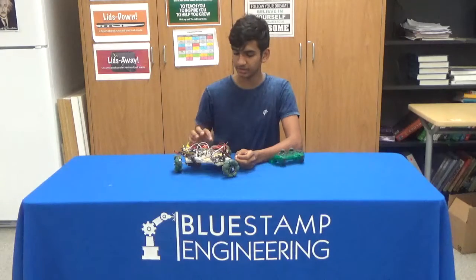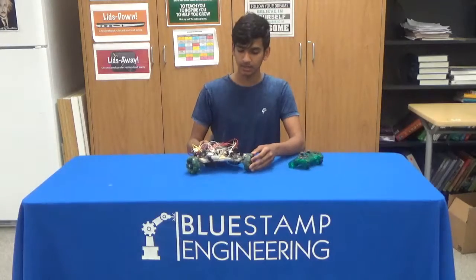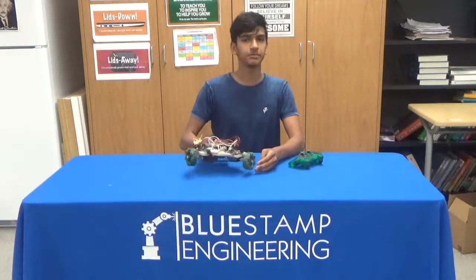Lastly was the coding, which is definitely the hardest part of getting to my second milestone. So during the coding, I actually faced a lot of problems, and the first one was that I had to solve just the basic physics problem of this whole project. Given an arbitrary velocity, at what speed do you move each of the 3 wheels so that you can go in that velocity with 0 angular momentum? And I spent a few days with this until I realized that the computer would do most of the work for me.